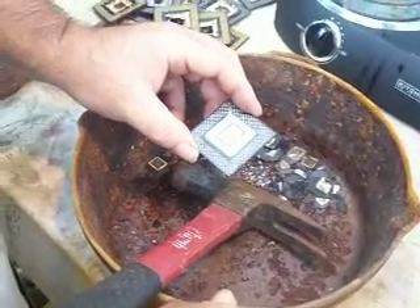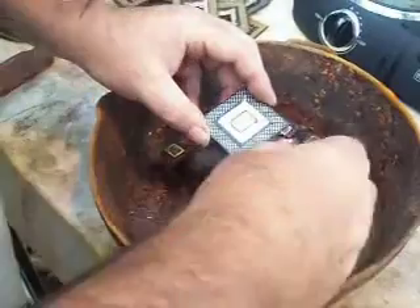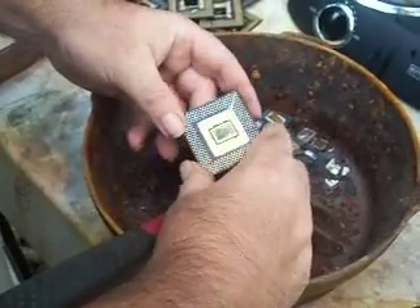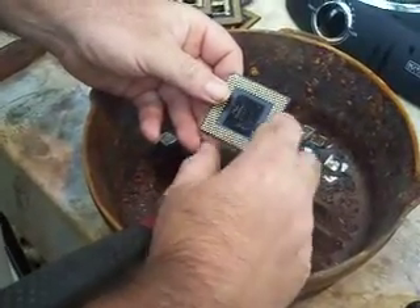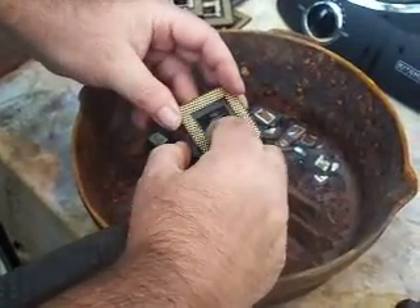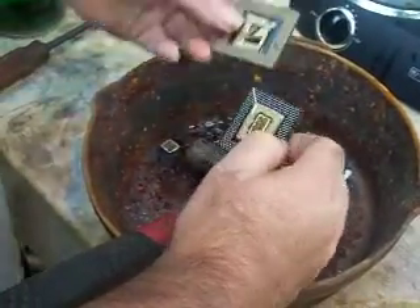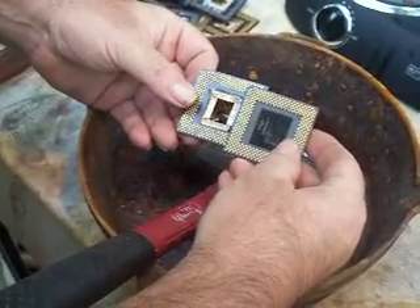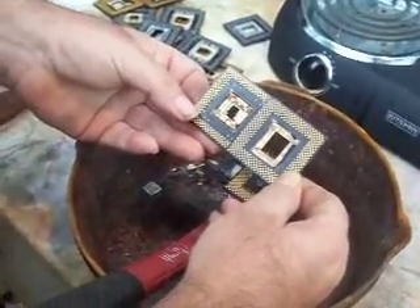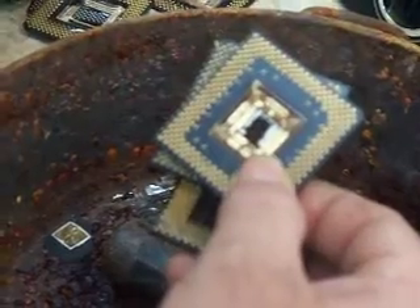The MMX lids have been removed. I think there's a couple of pinions in there, but what I'm doing basically is removing the chip. This black shiny resin part is where your gold bonding wires will be, so you have to remove that so they can be processed separately. This is what it looks like after, and as you can see, if you do it correctly, all the resin's gone, the chip is gone, the bonding wires are gone.